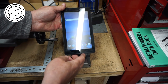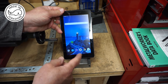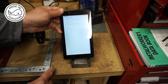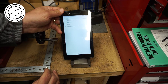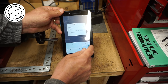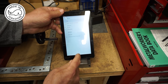I've already installed the TouchDRO application. However, before we fire that up we need to set the tablet so it can see the Bluetooth device. Go into Settings, then Connected Devices, Bluetooth, then Pair a New Device. It's found the AEL DRO, which is the Bluetooth device we need to connect to. We select that and it's asking for the PIN — the PIN is 1234. It's paired, so Bluetooth is running.